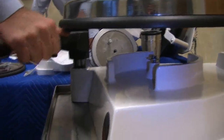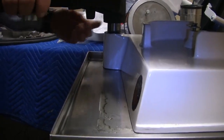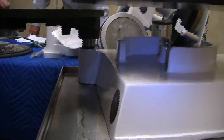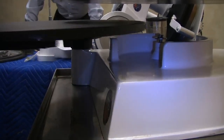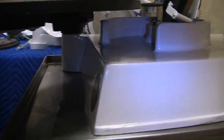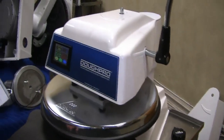The lower platen is only held by nothing. You can see it? If this thing is getting hard to turn, we may have to remove it, clean the grease and re-grease it. You grease that part with a food-grade grease because it's exposed. We call it high-temp food-grade grease. We have it here. If they put other grease on it, the standard grease that we use internally, that will turn black and start running all over. So it has to be used with a food-grade white grease.